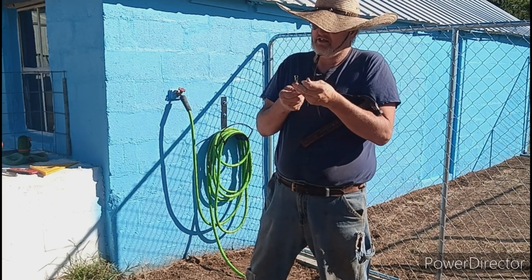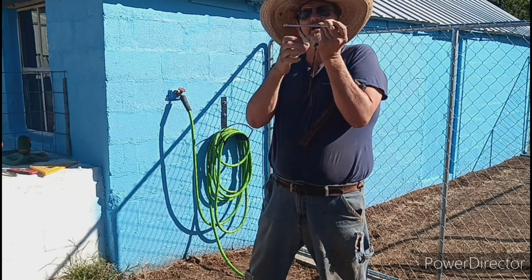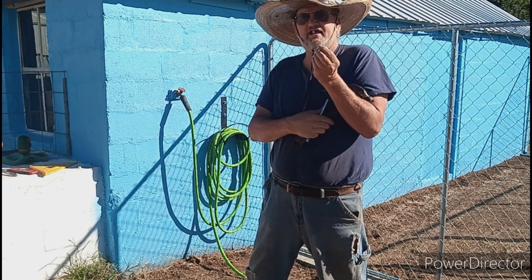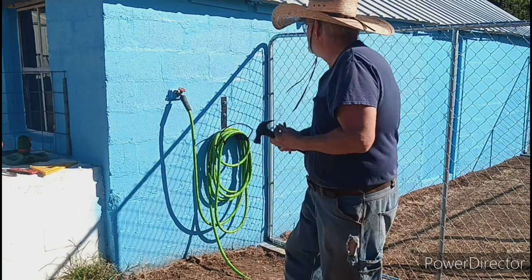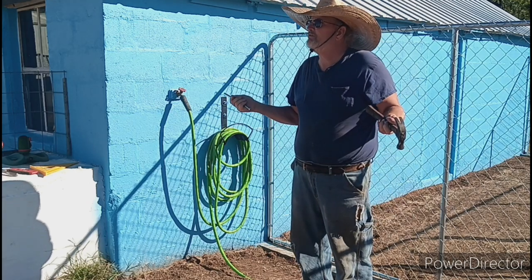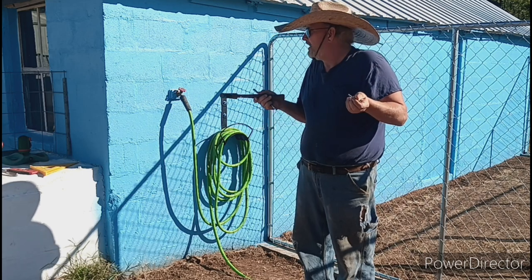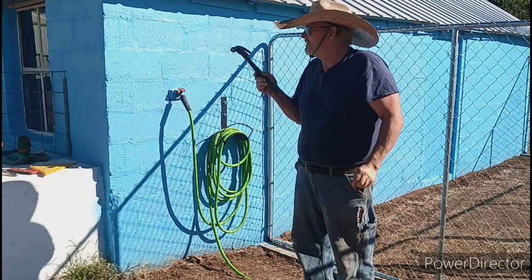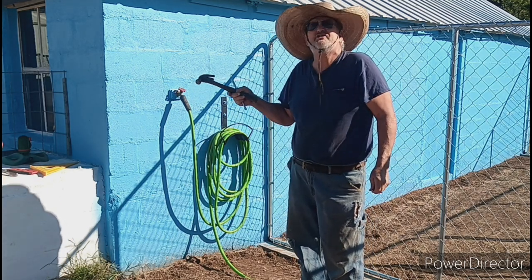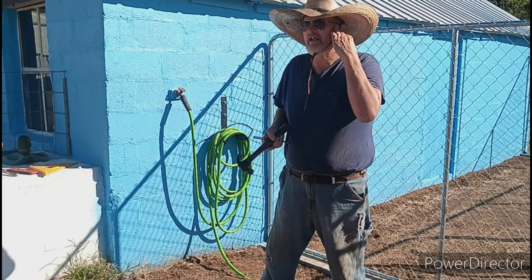Then you take this anchor — and this socket, it's an 8mm. You slide it over and you hammer it into the wall. Then you take this off and you hammer the nail in flush. I got one of them — they don't move. You need to work with concrete or brick, and of course the masonry bit, whatever size — it's quarter inch. I got a three-pack of the impact masonry bits for like $18. Sure beats spending $9 for one, and it's a Bosch brand.